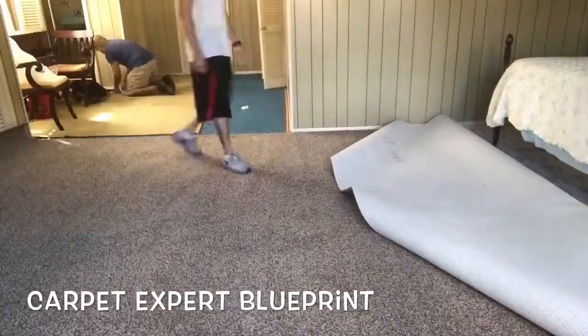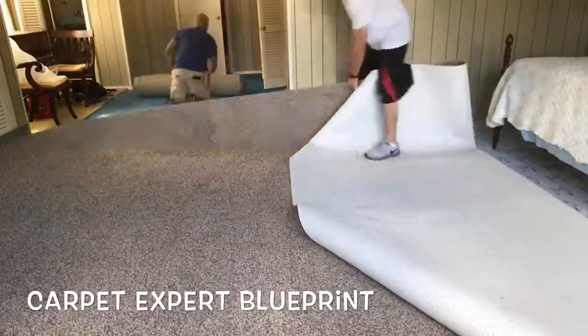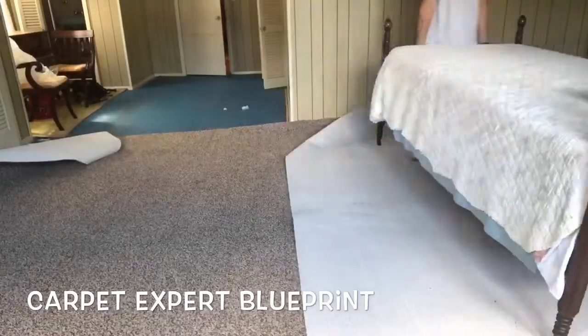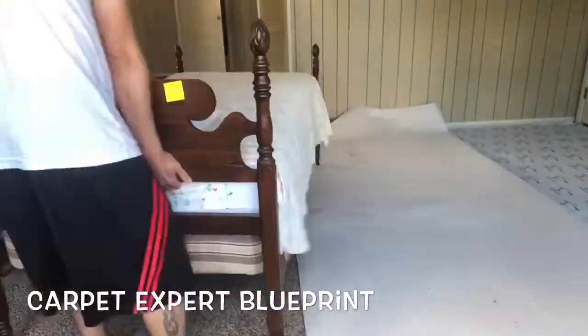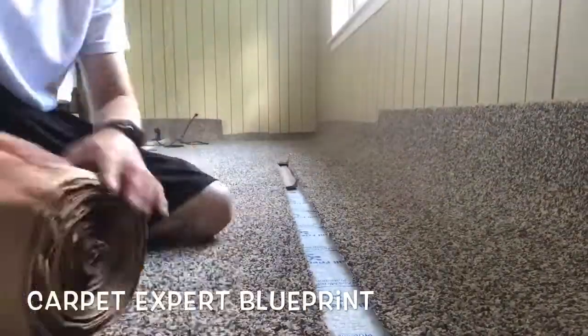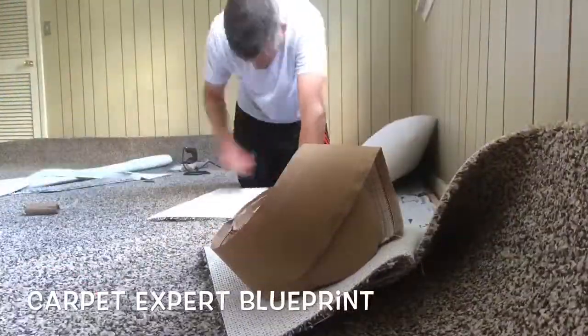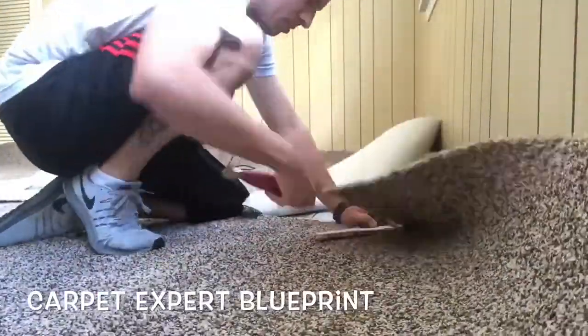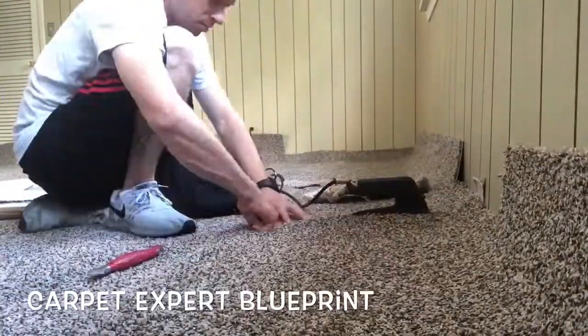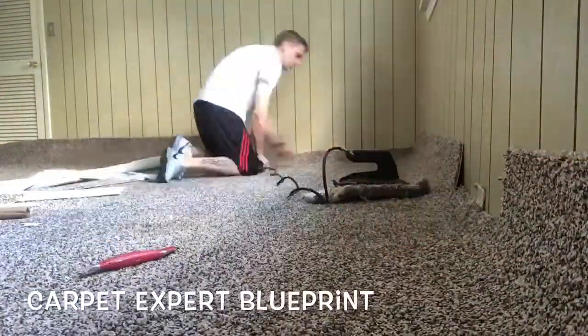We're taking our plush carpet and getting it all laid out. Once it's positioned on one side, we're going to pick up the bed and set it in the middle so I can go ahead and stretch everything in, and then from there we can stage out the rest of the areas. Here's the seam to the room — just cutting down the seam, getting it taped, and I'm going to overlap the cross seam. Cut both edges and mark it down the middle, like I've done in countless other videos. You can check those out if you want to know exactly how to do that in real time.